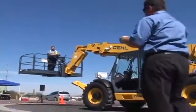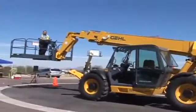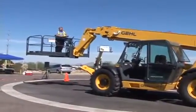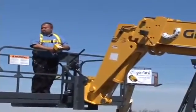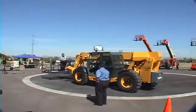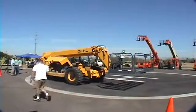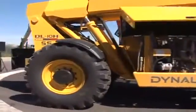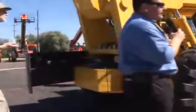You can basically boom up, boom down, extension, retract. The valve bank and counterweights are accessible right in the back of the machine. We do have some big oversized boom cylinders back here, as well as slave cylinders for self-leveling and upward motion.